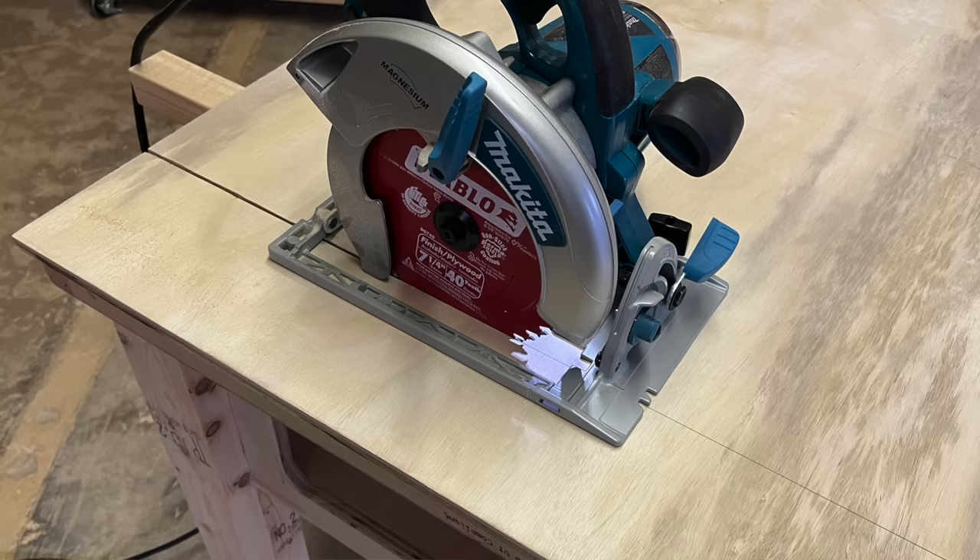That's how you make a straight line cut freehand. Keep in mind it'll never be completely perfect because of those tiny micro-adjustments — everything shows up on a board. This is why you don't want to cut freehand on projects where perfect lines matter, like cabinet work. You want to use a saw guide or straight edge for those projects. But for shop-grade stuff or some exterior things, this line is straight enough that people won't notice it. I cut much of the stuff in the shop freehand, and I often hide those rough cuts in blind joints so they're not as obvious.